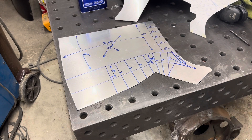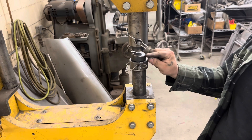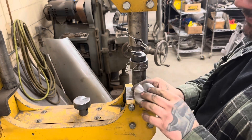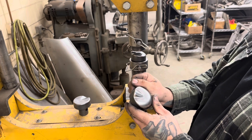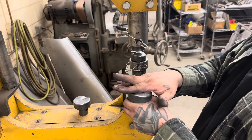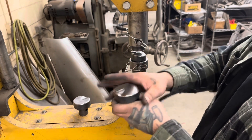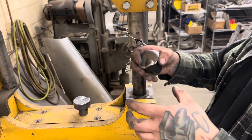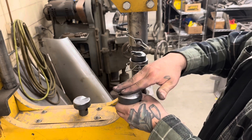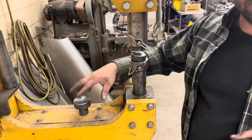We're all set up here on my Bailey MH19 power hammer. I've got the mini thumbnail shrinking dies in there. A thumbnail die is a male and female die — it's got a little thumb that sticks up, and as the material comes in while the machine's running, it'll put a tuck in the material. As you pull it back out, it'll gather in around the thumb and you're essentially gathering up the grain structure and thickening the metal. It's squeezing everything together and thickening the metal so it'll shrink. I'll do the demonstration and we'll do the light shrinking around the edge.